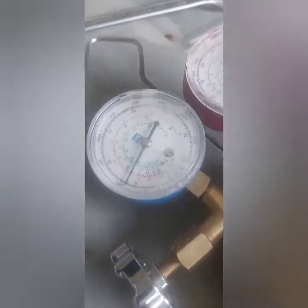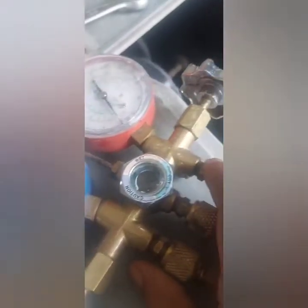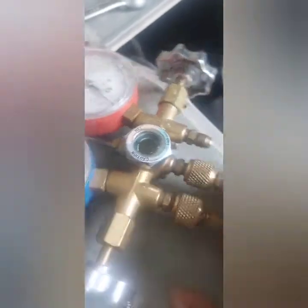Topping up the gas now. I kept it at 80 — for R407C the suction pressure should be 60 to 80. Now it's making actually very good cool.